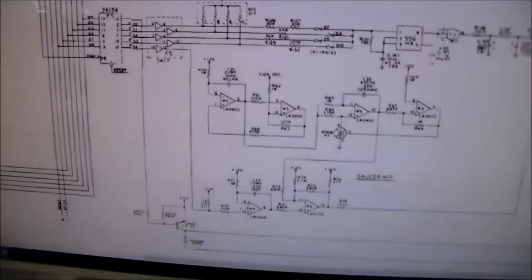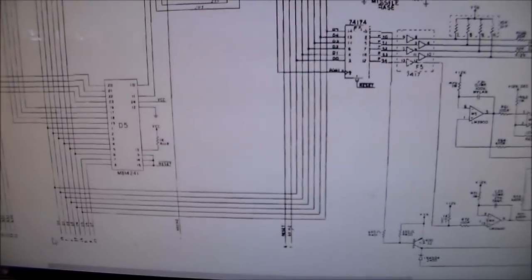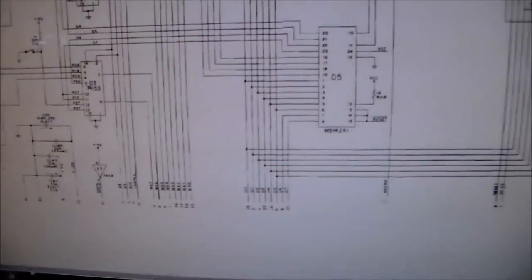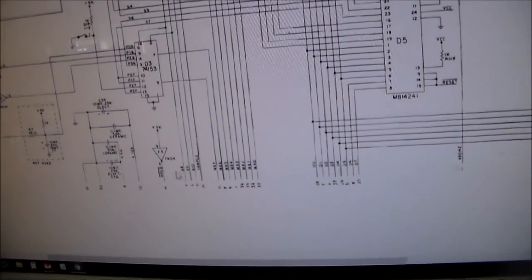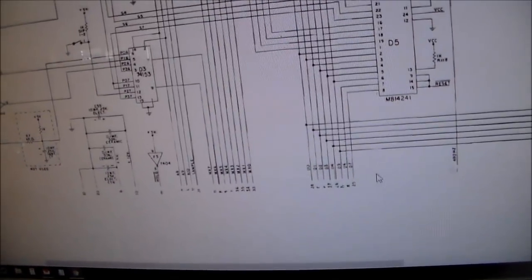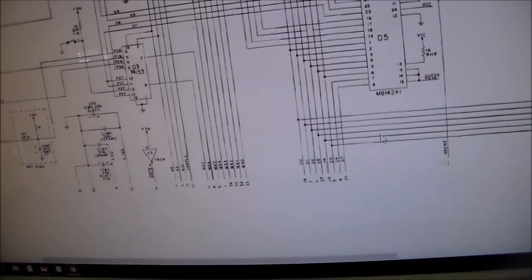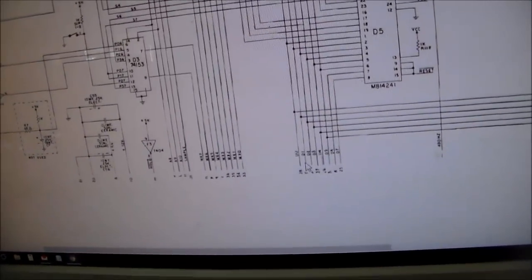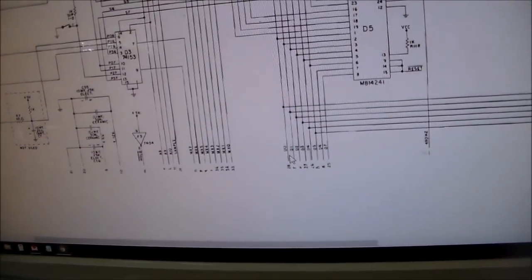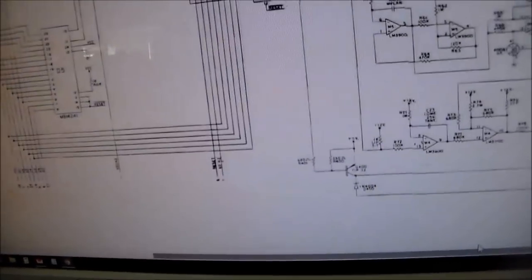All right, so we've done several videos on how to fix sound in Space Invaders. So basically what you have in the schematics is these are signals coming from the main board, and they go through a big socket on the edge of the thing. So it could be that it's trying to send the signal through and it's not making good connection because that socket's dirty or something. So we're going to remove the daughter board and plug it back in just in case.